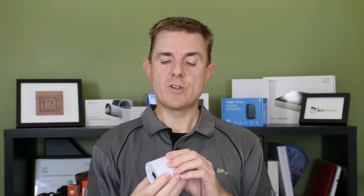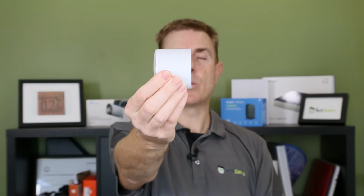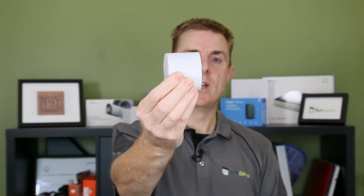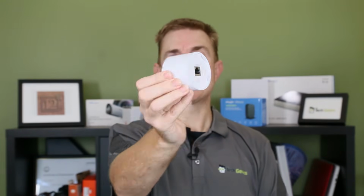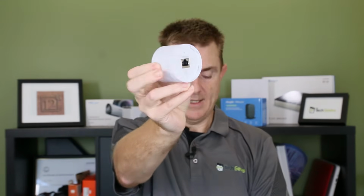And then let's talk about the fitments for the chime. So let's work through the chime. This is the chime itself. It gives about 80 decibels. There aren't multiple types of ringtones. There is one ringtone to it. You can change the volume level of it. Like I said, this is true PoE. PoE in this side, and we've got a reset button in there as well.